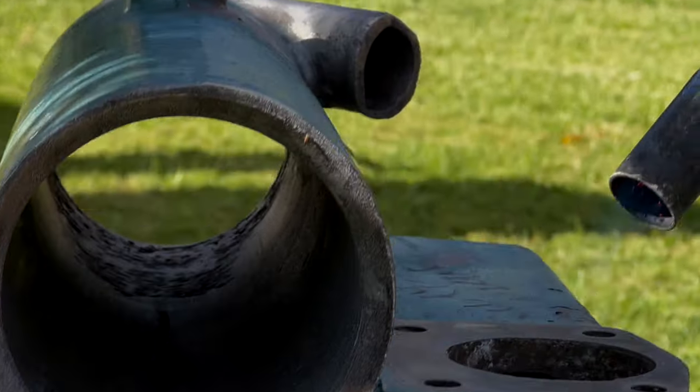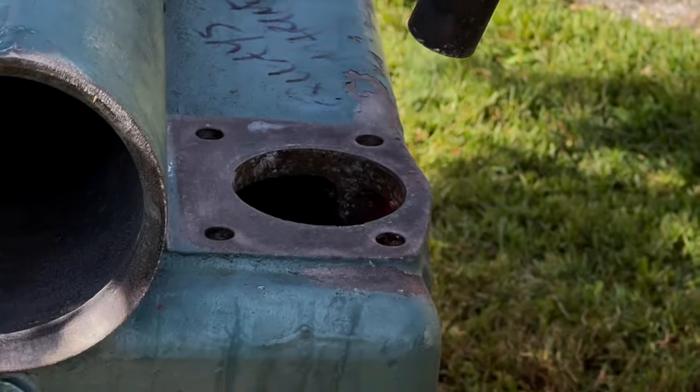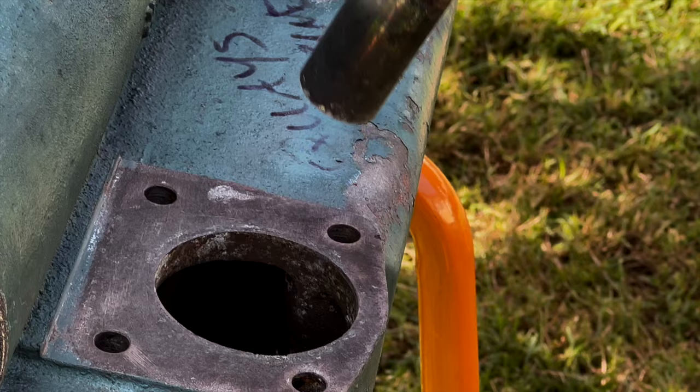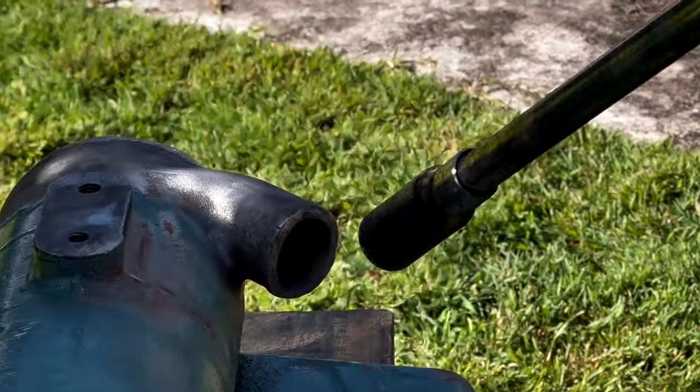The biggest challenge that you face is that oxidation of the aluminium surface reduces the adhesion of epoxies. So you really have to get the surface preparation right or you're just wasting your time.